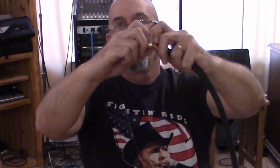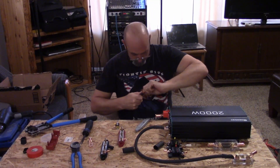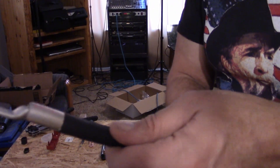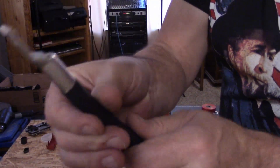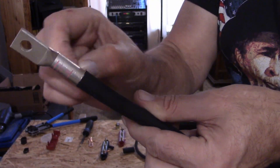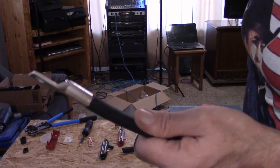Let's take and get a little twist on those cables — make sure everything is together because we want to get every piece of wire in this. So let me take a second to get that. Take your time. With some persistence, this is fairly tight around this 1-0. I've got one, two strands right there — I can live with that. I'll clean those up real quick and then we'll get it crimped and put a heat shrink tube over it.